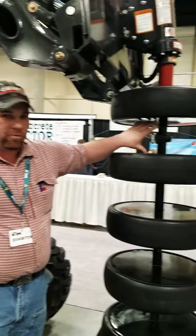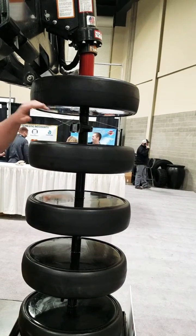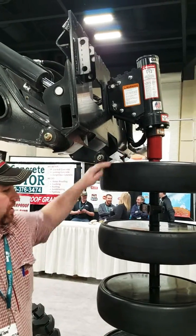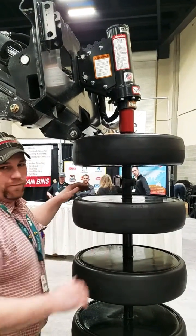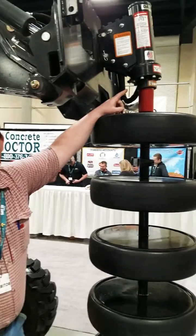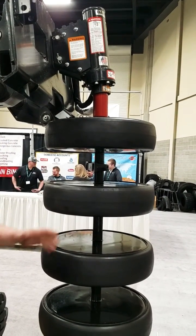We've had a lot of guys that wanted to use presses, and those ended up damaging the drums. So what we're doing now is we have a tool that we attach to the packers. We have a big steel plate that comes down inside that goes onto a forklift. We pick the packers up and actually use vibration from a post pounder that causes vibration in the whole packer gang assembly.